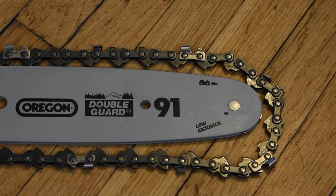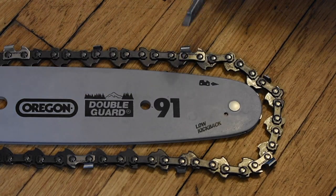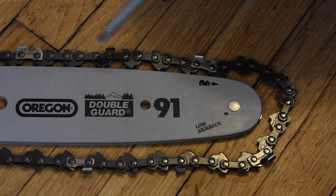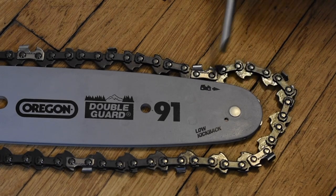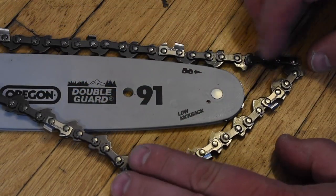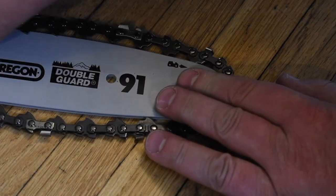Now we are in. Here is the directional arrow showing how the chain should roll — it's rolling this way. It has an arrow here, and there is a picture of the cutter. The cutter is this piece here — here is one, there is one, here is one. There is clearly a different color than the others, and this one has to match this shape here. So this chain is correct. If you put it on the wrong way, it will not cut. That looks completely different — it has to be the other way around, this way. That's how the chain goes on.